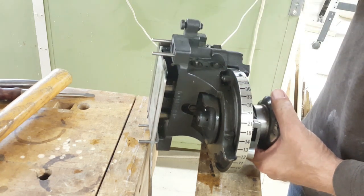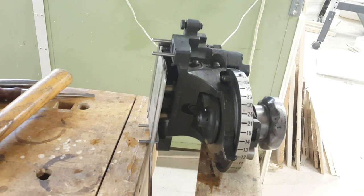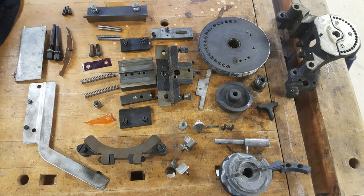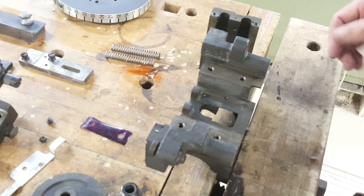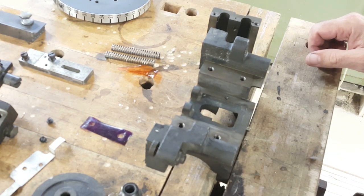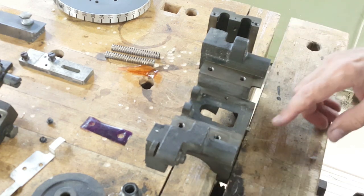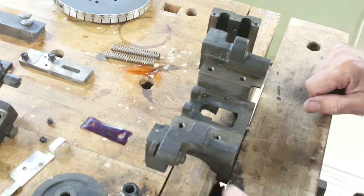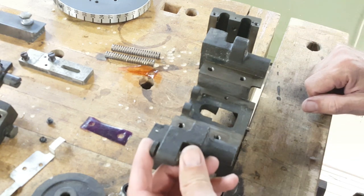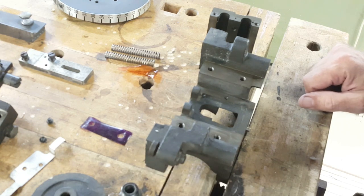The rest of this video is going to show you just the putting it back together, and it will start with a picture of all the parts laid out on the table. I'm going to reassemble this knife block from a Linotype. I've pretty much stripped it all down. This is the base casting. About the only parts left are a little pin that stops the sector wheel from turning all the way around, and a stop which actually stops the right hand jaw of the vise.